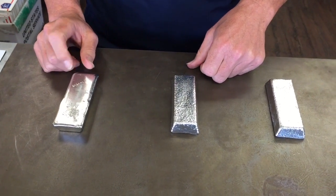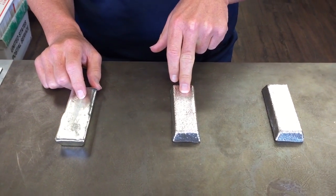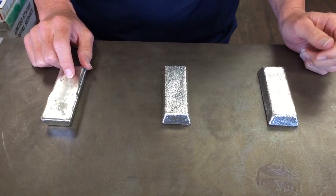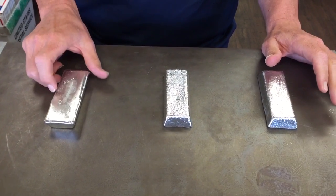And finally, the AC has a quarter percent of copper in addition to the high amount of antimony like the R92. In the long run, that gives you more malleability and the ability to do more forming once you've finished with your casting.